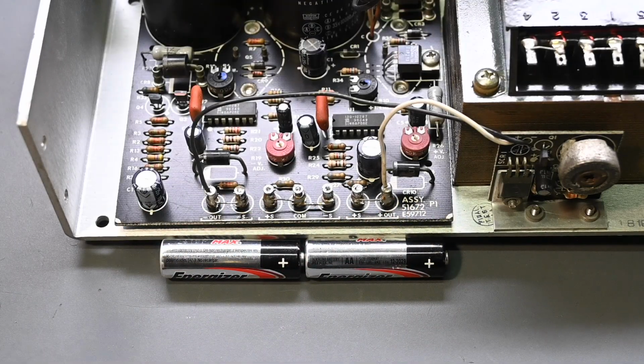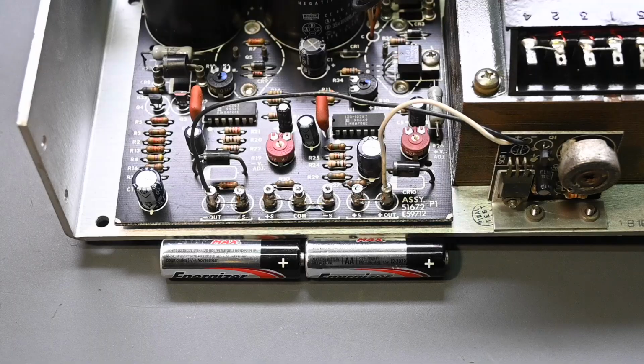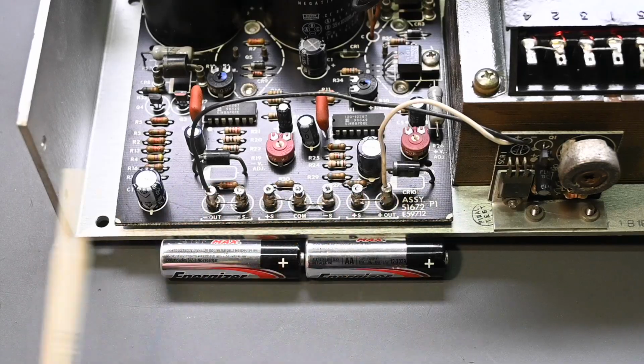And maybe it's a 50 volt and a 50 volt power supply. Suddenly you have 100 volts between the positive and the negative output. That's a shock hazard. You don't want to mess around with 100 volts. And that comes into play in audio amplifiers. It's very common to see dual rail power supplies of, let's say, 50 volts, or 35 volts and 35 volts, numbers like that. And they add up very quickly across the two rails and become a definite shock hazard. So always keep that in mind when you're working on dual rail power supplies.